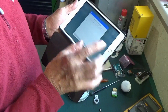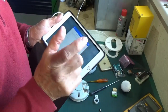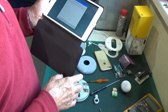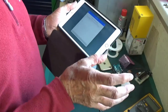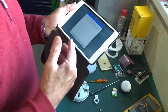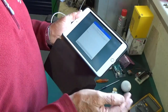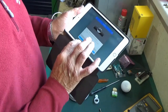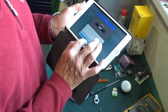Is it going to be an on-off thermostat? No - not in my case because I want to use the OpenTherm connection. However it's still a smart thermostat in the fact that it'll do far more things than a standard on-off thermostat - it'll also look at different conditions about the house and outside. I'm going to go for OpenTherm because that's what we're using here. It's asking me to find a Nest pro - I don't think so. Next.